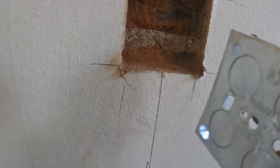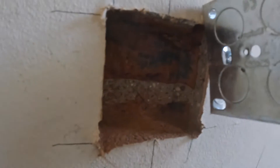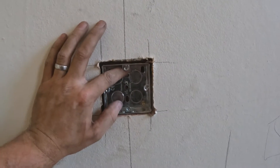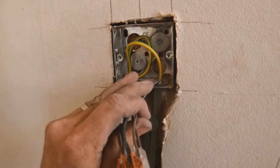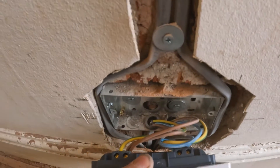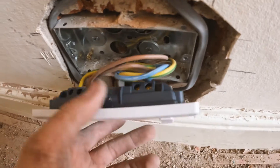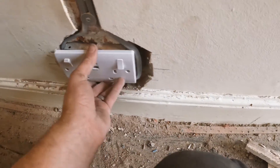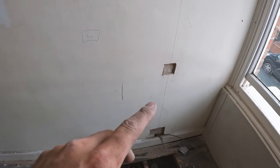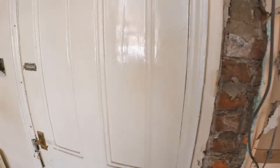So the cables are wired. Just chasing these back boxes and getting the chasers in. Good tip: go back and forward with the drill bit, side to side to get it nice and perfect — not angled. The larger chasers need to be flush so the box fits in perfectly. That's the switch wired up — cable's in, back box earthed, the cable's ready. Brown to L, blue to N, earth to earth. Once that screws back it'll go nice and flush. The plaster will make it look good. Then we're chasing the same setup on the other side — you'll be able to switch the light on from the bed, and over by the door.